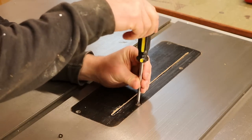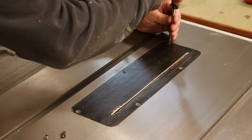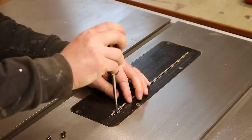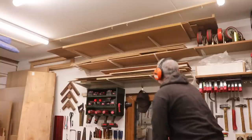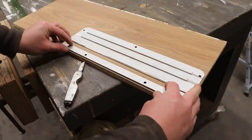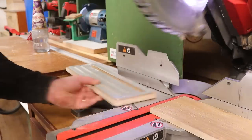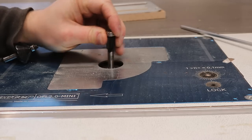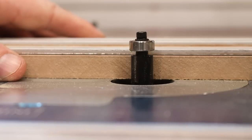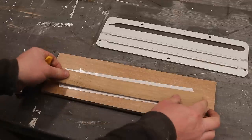The second big issue is the insert plate. Messing about with tiny machine screws every time I want to change a blade is infuriating, so I need to design and make a tool-less insert plate. The insert plate currently fitted I made in a previous video — I'll leave a link in the description — but for the new one I found some 12mm MDF with an oak veneer on the front, actually a plasticky fake wood laminate that came from an offcuts bin at my local DIY store. I used double-sided tape to stick down the insert plate that came with my saw as a template, and I should be able to get two plates from this one board. I fitted a bearing-guided flush trim bit but then realised I couldn't get the bearing referencing around the plate while still getting a full cut, because of the small gap between the bearing and the cutter, so I taped on a shim as a spacer to solve that issue.